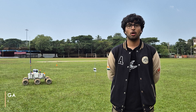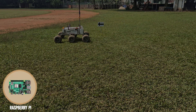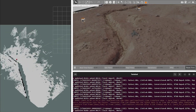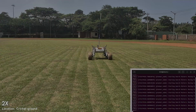For the autonomous expedition, we have switched our primary framework to ROS2. The Jetson Xavier NX integrates data from all onboard sensors while the RPi converts command velocity into PWM signals. Differential GPS and IMU data are fused via an extended Kalman filter to generate odometry. Our RTAB-Map uses odometry and ZED2i depth images to create a 3D map, classifying points as obstacles based on slope for obstacle avoidance.